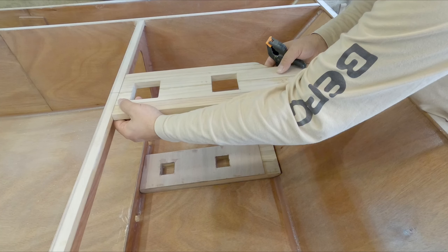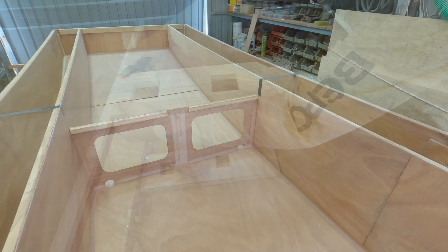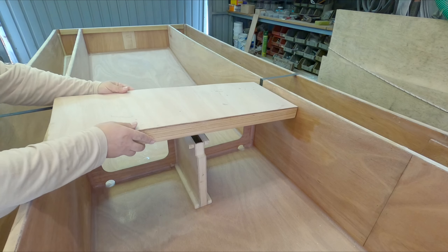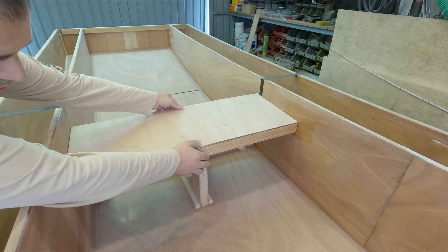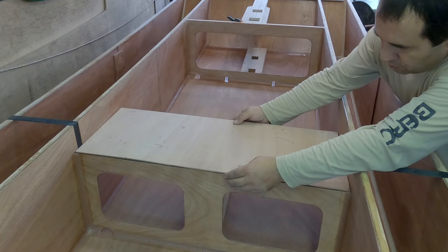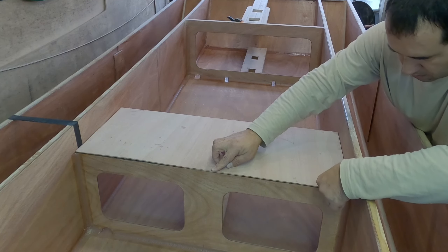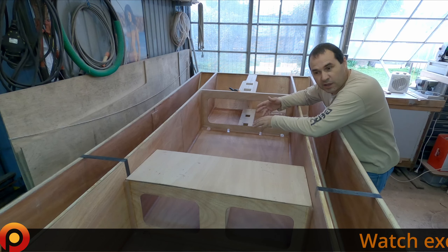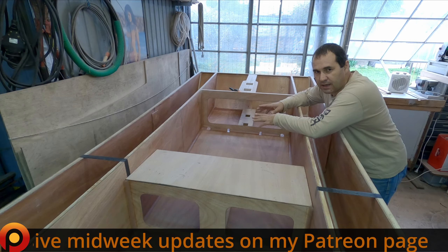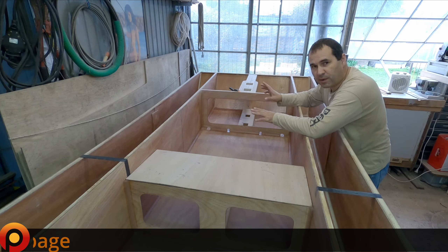The mast step has been rounded to match the fillet. It's better if this part is a few millimeters short rather than a bit too big, because if it's too big the part will be off the bottom — you want to make sure it's right on the bottom. The mast partner is exactly the same thing: you do not want this to be forcing the bulkhead that way.